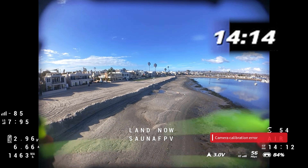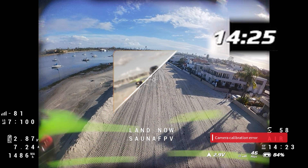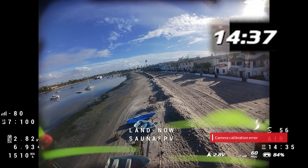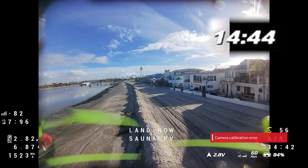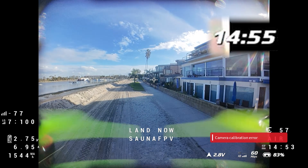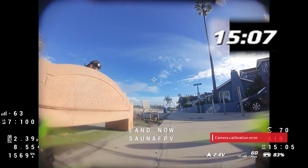14 minutes — that's what I was expecting. Thank you to 87NoStab who inspired me to make this video — check out their channel, super chill vibe. For this flight I tried orienting the battery in a toilet-tank style instead of the long way like yesterday's flight, and I feel like this was more stable. Still some micro shakes, jitters, and a lot of jello even with the Flywoo wide FOV adapter which never gives me jello on lipos — so maybe there is a PID tune thing. Overall I'm pretty pleased. I think I might be able to get close to this on a 1K milliamp-hour lipo since they're so much lighter. It was less heavy-feeling than expected — I was at about 90 throttle — and I did brown out when I hit the cutoff voltage, it literally fell out of the sky and then recovered. Lucky I brought it in when I did.